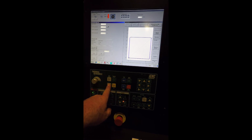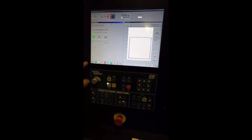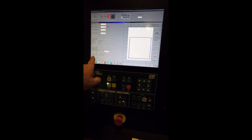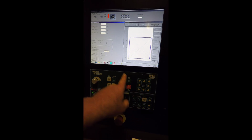and then go into manual mode again. We're jogging in the x-axis, torch to the left of us, and we're going to find the edge of that plate, and then we're going to hit plate alignment. Okay, let's start that over. Okay, we jog, we find the first position. Okay, so this is plate alignment.